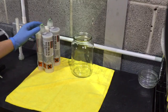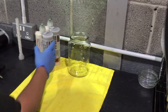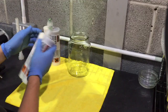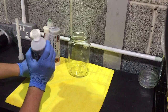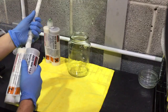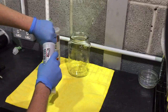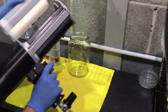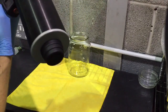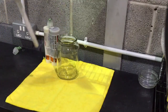We've got our warmed structural foam now — soggy labels to show it's been in the water warming up — and we've got a bone-dry glass jar. Now we'll start the process of the installation. We take the little tops off, unscrew the caps, pull the plungers out, set them to one side, screw the mixing tube on, make sure that's nice and tight, offer it into the gun, connect the airline, and we're going to try to do this without moving the jar, so I'll have to hold this vertical.